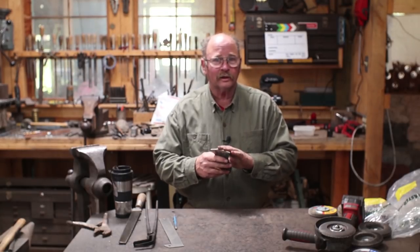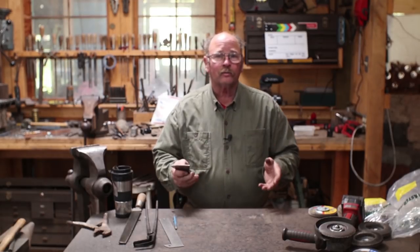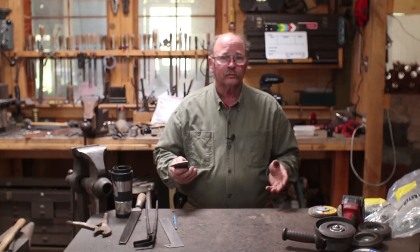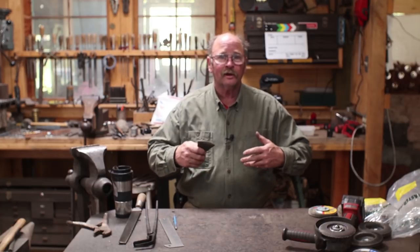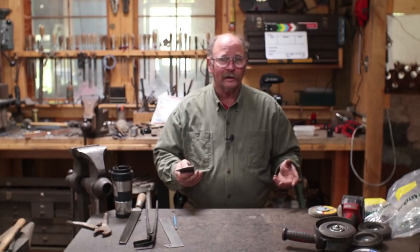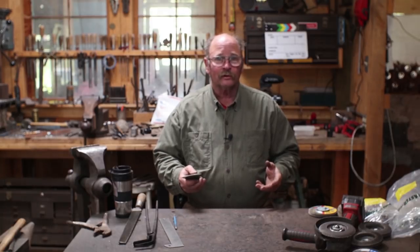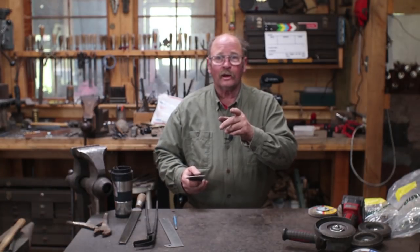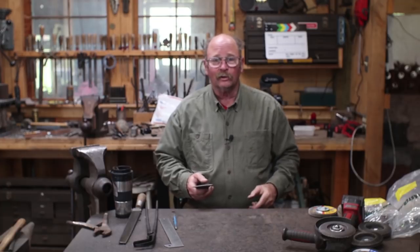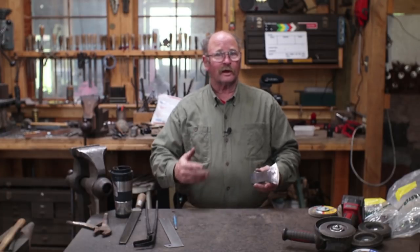And then we will quench this in the same commercial heat treating oil that I always use. It's just a product I bought from a local oil supplier. I said I need 5 gallons of heat treating oil, and they ordered it for me. I don't remember what the brand is, but there is stuff out there. Parks 50 is a good brand. McMaster-Carr sells a couple of different grades. And somebody gave me a link a while back to Black Bear heat treating oil, and when I replace this, that's probably what I'll buy just because it's got a cool name.